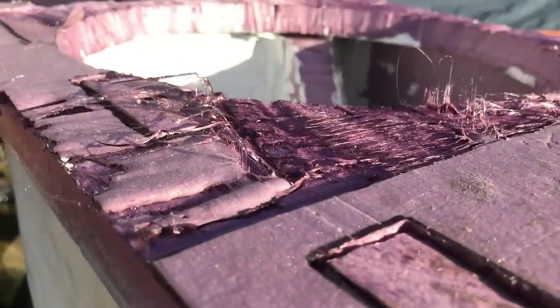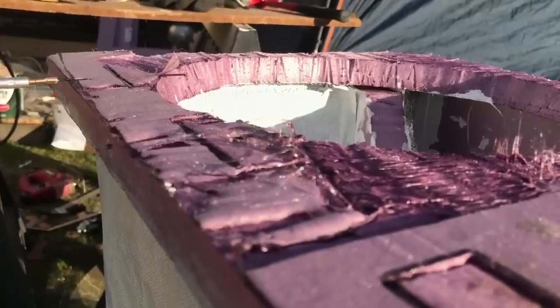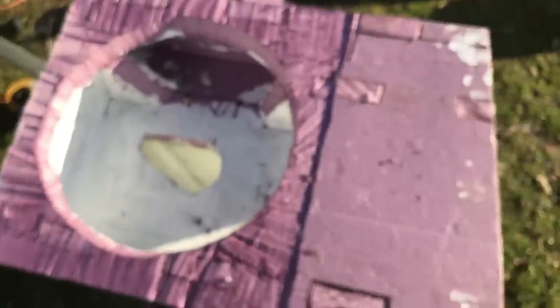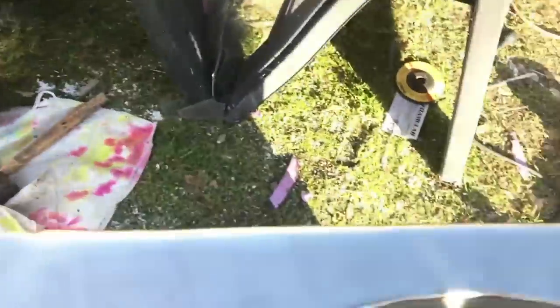The original sink is about a sixteenth of an inch thick stainless steel and I need to inset that so everything lies flush on top of my cabinet. This is another thing you'd never be able to do with an X-Acto knife — shaving off these paper-thin pieces of foam would never happen. It looks a little rough but I'm going to glue the sink down and you'll never see that part. That texture is probably good for bonding the stainless steel to the foam. I can get a really precise, flush joint between those two pieces. Once I place the stainless steel countertop on — the fit looks really good, laying pretty close. A little bit of silicone there is going to be just the trick.